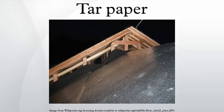Common grades include 10, 20, 30 and 60 minute. The higher the rating, the more moisture-resistant and the heavier. A typical 20-minute paper will weigh about 3.3 pounds per square, a 30-minute paper 3.75, and a 60-minute paper about 6. The smaller volume of material, however, does tend to make these papers less resistant to moisture than heavier felts.